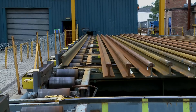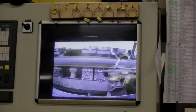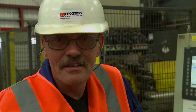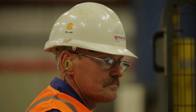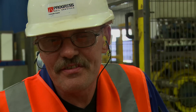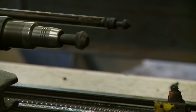The first part of the process is cutting the rails to length from the CNC saw machine. CNC means computer numeric controlled, meaning the saw is pre-programmed to follow an individual switch or crossing design. I upload that program from the drawing office and this machine will drill and cut to whatever is required. It's a big bit of kit, but when you consider some of the rails it's handling are 120 foot long, you do need a big bit of kit. I've got 16 different sized drills to choose from, and a tungsten carbide saw blade that cuts through very easily.